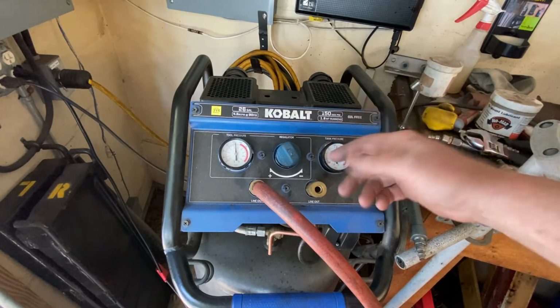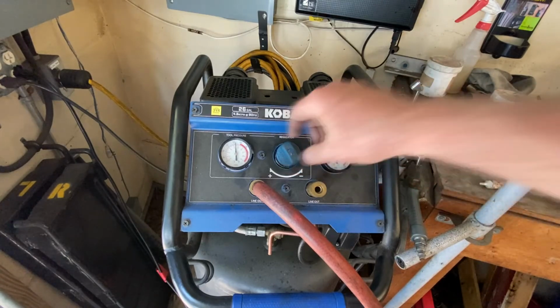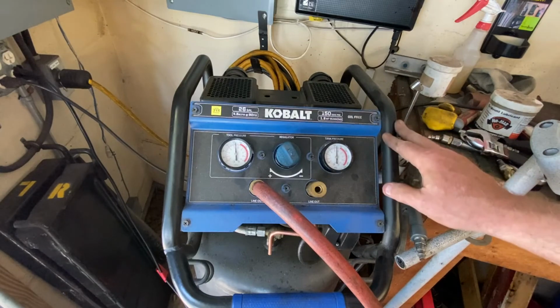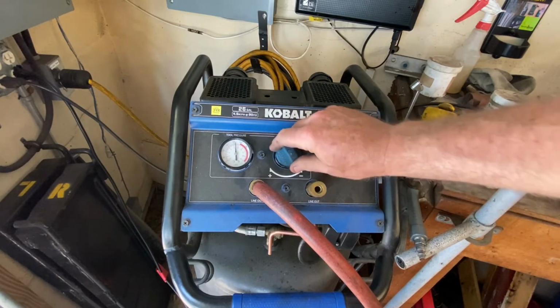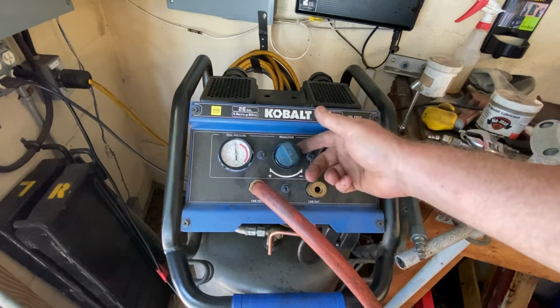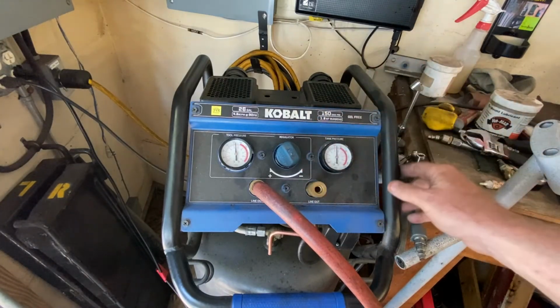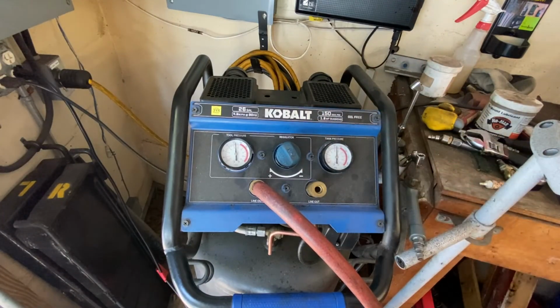Put a little screw so this thing again is held in so it doesn't back all the way out when you turn it, and then just do all the rest of that, and you'll have a whole new functioning unit once you drill and tap out that body, which is super easy because it's, like I said, peanut butter. Okay, so we're done.